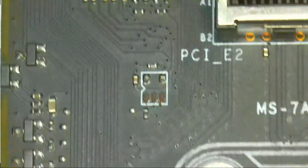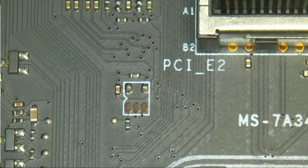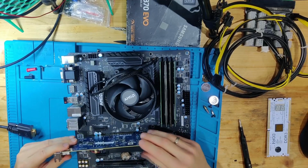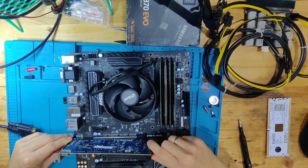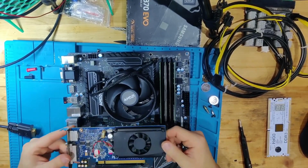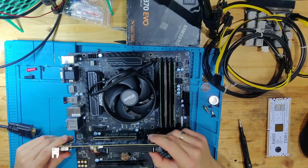This happens from very heavy GPUs, from big GPUs that people struggle to get out of the PCIe slot. What very often happens is someone has a big graphics card right here. It's inserted. You release the latch, so it should be open, and they pull on this side or on this side, and the latch gets stuck again. Doesn't happen with this small GPU. And then people start prying, trying to get the GPU out. And the same could actually happen when putting the GPU in.